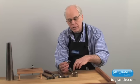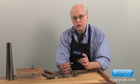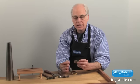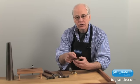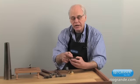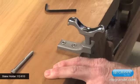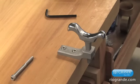The hole in the middle will become smaller, so you may need larger starting stock than with a concave bracelet, because this is actually going to be compressed in, and the gauge of the metal actually, if it's done correctly, will thicken. All the Fretz tools fit in a holder. They're a solid fit.